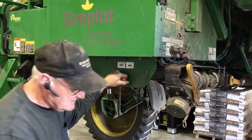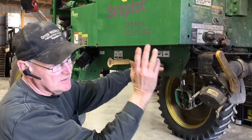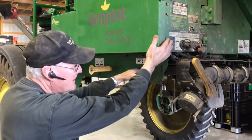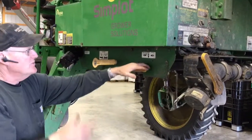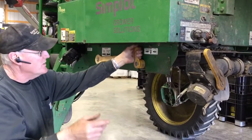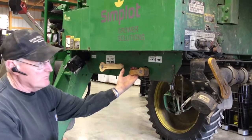You can leave this at bypass, and you go up and dump your tank cleaner in. As you dump your tank cleaner in, it doesn't even hurt to put in a little bit of defoamer. Once you've got that in, you turn it back on and run just a few seconds through bypass, a few seconds of spray, then you go to tank rinse nozzles.